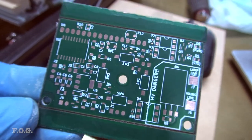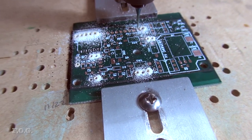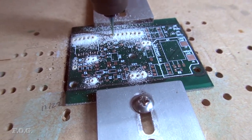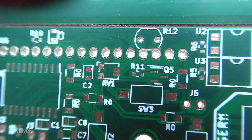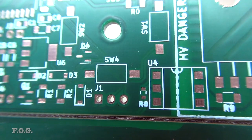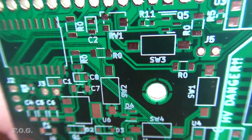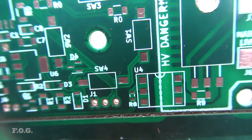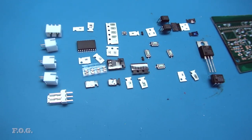After a manual touch-up and polish, the pads look pretty good. Sadly, drilling the pad holes didn't go as smoothly—I managed to break my two only 1mm end mills in quick succession, and even using a 1.2mm end mill for the LCD header, the holes ended up closer to 1.5mm. I thought I might need to redo the entire board, but thankfully it was still usable. The root cause is likely excessive runout in the spindle, collet holder, or collet—all cheap parts. On the back of the board I used the laser to burn a connector information overlay, which works pretty well.